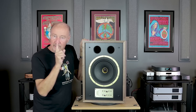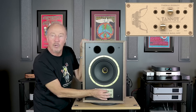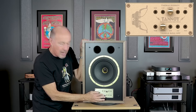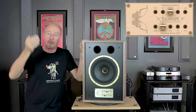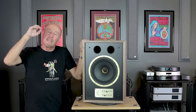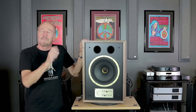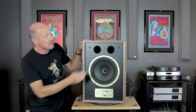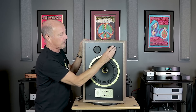You can fine-tune this to your own personal taste. There are two adjustments on the front: one for tweeter energy, where you're able to go up or down a total of 6 dB; and one that adjusts the crossover slope — not the amount of energy, but the character of the top-end. If you change amplifiers, say from a solid-state amp to a tube amp, or find that your solid-state amp is a bit bright, you can tame it down. You can also adjust the bass response with the bass plugs, though I don't think anybody would want to because the bottom end is just unbelievable.